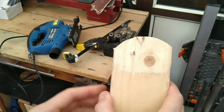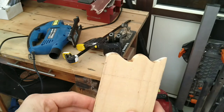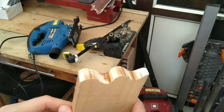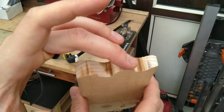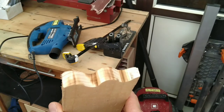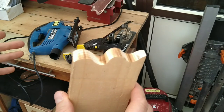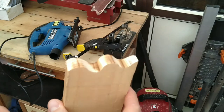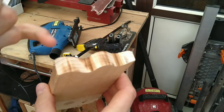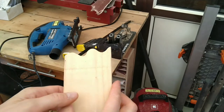Compared to the wide curve we had before, that one is a much tighter line. You'll notice there are some burn marks on the inside — that's because I didn't adjust the jigsaw speed down; it's still on speed six. For tight curves like this you might want to adjust it down to four. But if the burn marks aren't visible, or if you're sanding it, or you're not bothered about them, it's perfectly fine.